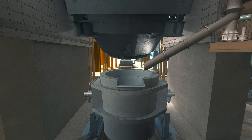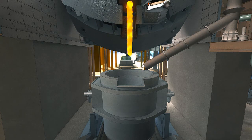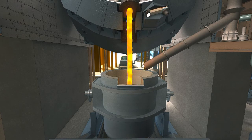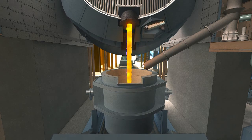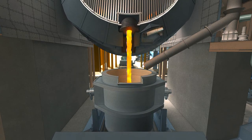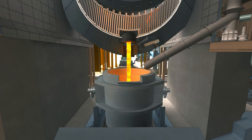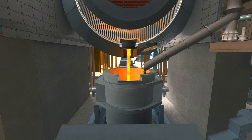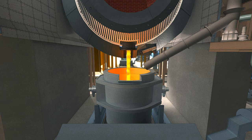The converter is tilted to 75 degrees at high speed and checked whether steel comes out from the tapping hole. From 75 degrees to 98–100 degrees, the converter is tilted slowly while checking whether slag overspills through the converter mouth. The teeming ladle transfer car also moves slowly according to the tilting angle of the converter. When one-third of the teeming ladle is filled with steel, the feeder of the relay hopper is operated and ferro-alloy is injected to adjust composition and for deoxidation.